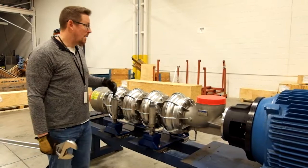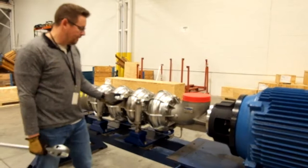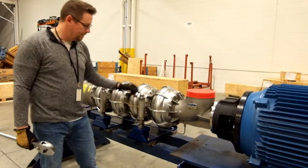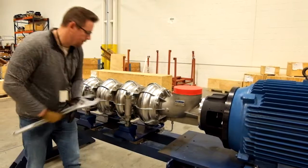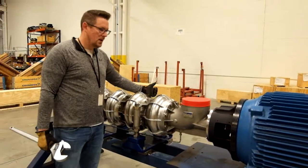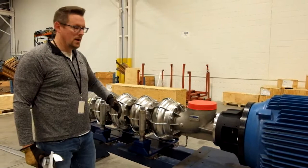At that point the crane is released. The last step is to secure the support bracket the same way as before: run the bottom nut up until it's snug to the bracket, take the top nut down and snug it, use the wrench to tighten it, then run the bottom jam nut into place and snug it. Once that's done on both sides, the process to aligning the FEDCO MSD product line is complete and everything is set and ready to go.